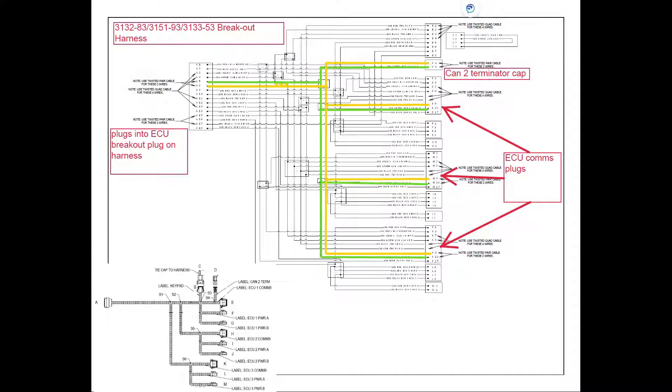Back to our ECU breakout harness — we are going in with CAN high and low on pins 7 and 8. These three plugs are all identical. The only ECU using the signal from pins 7 and 8 is our master ECU. The master ECU on the air seeder tank is always located closest to the tank wall; it will be at the bottom of the stack. That communication is done through pins E7 and E8. For the rest of the ECUs to pick up, they receive the CAN signal after that ECU, coming out on pins 9 and 10 from the master ECU, allowing us to splice in the other ECUs.